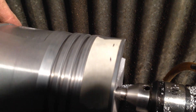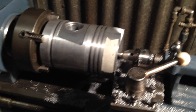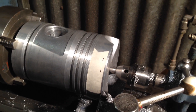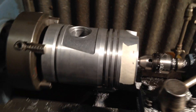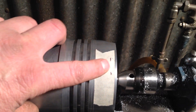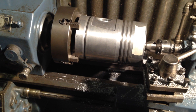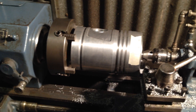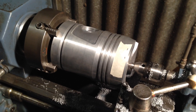That's the process — I just need to square that piston a little bit more. I'll cut the top off down to these marks, which will give me my 8mm and should reduce the compression a little bit. We'll see if it works. I don't think it's going to be detrimental to the pistons — I can't see it hurting them in this application having a bit taken off the top.